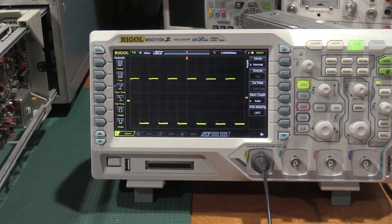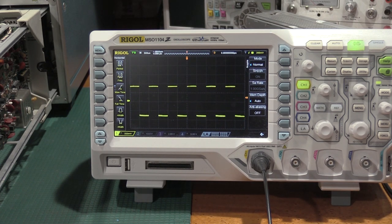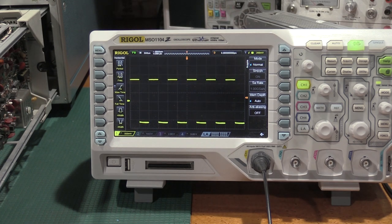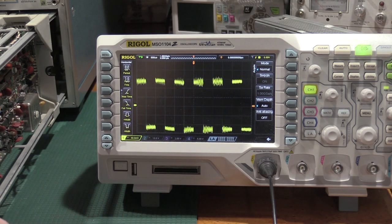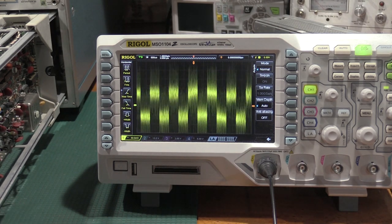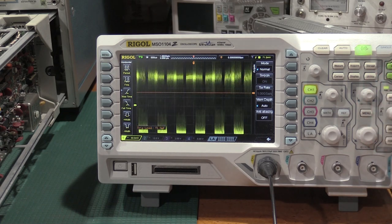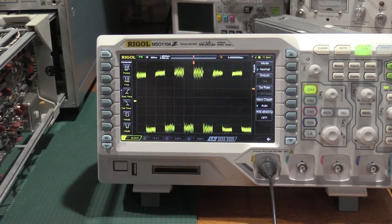Now to prove it, put a 10x attenuator in and let's go to 0.1. Let's see how it's doing. Well, that's cleaned up quite a bit. That looks better. Need to knock the attenuation down a little bit more. Still, signal's still running a little hot, but I have it turned way down. Yeah, it's still a little noisy, but not as bad. Yeah, wasn't that plug-in, but everything looks better now than it was.